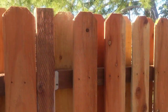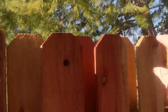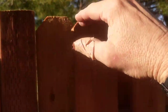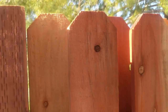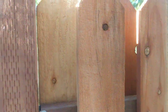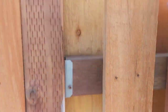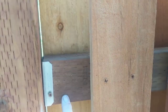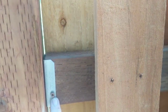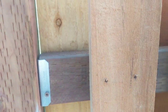Another advantage is the construction of them. Because our posts are now exposed, we can put a 2x4 across the top so our heights can hit there instead of against a string. We can hit the 2x4. Just screw them in on either post and that will set your height. And then of course your rails are held in these brackets and they're also going to be the narrow side on the top so that they won't sag as they would if they were reversed.